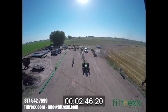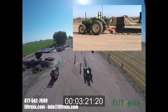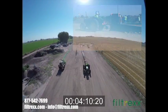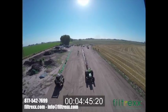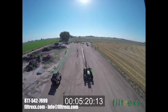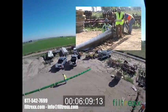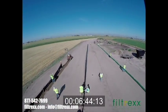There is a natural gas line that runs through the test area. The plow has to lift out of the ground to avoid hitting the gas line. The Filtrex crew and silt fence plow crew lay down 200 feet of material in just under five minutes. However, the silt fence plow crew still has to hand dig a trench over the gas line, set stakes, staple the fabric to the stakes, and backfill. The Filtrex crew just needs to stake in the silt socks.